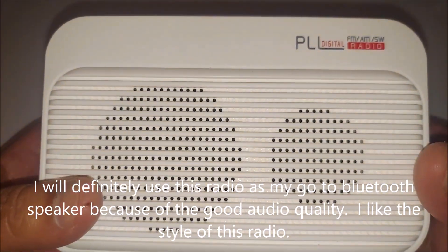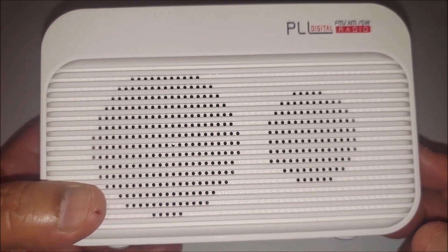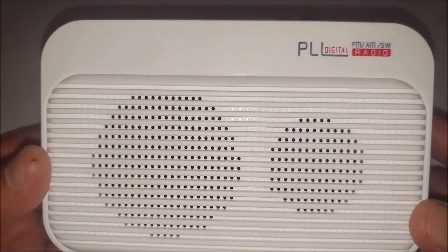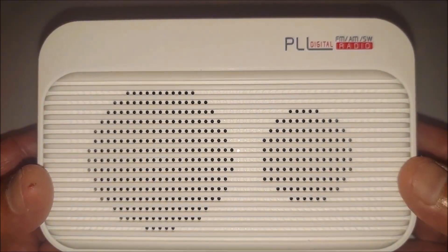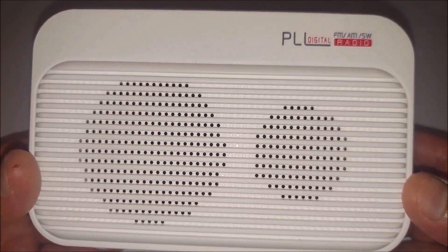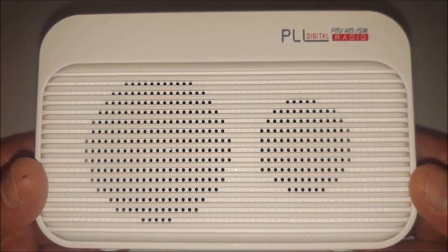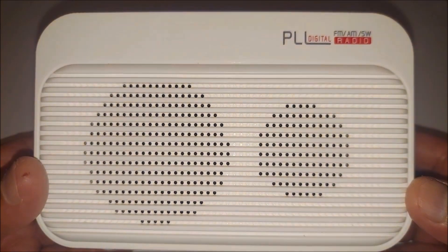Overall, if you're not looking for a shortwave radio, this is a good radio. If you don't care about shortwave — and I think shortwave just needs that fix, 50 kilohertz is way too wide — then this radio is good. FM reception is average; I have smaller radios that will pick up weaker FM stations. AM radio is above average — a little too wide for DX, but I did pick up long-distance stations. I like that you can use both micro SD and USB for MP3 playback.